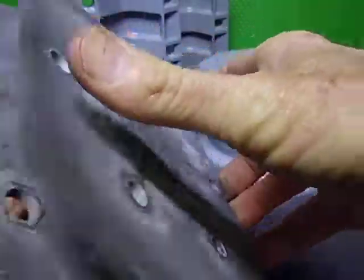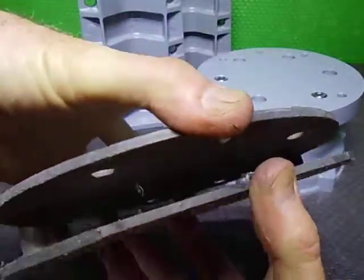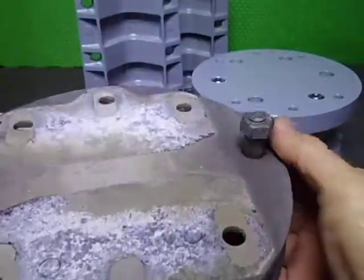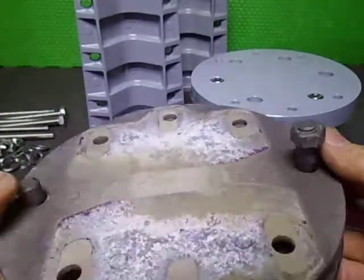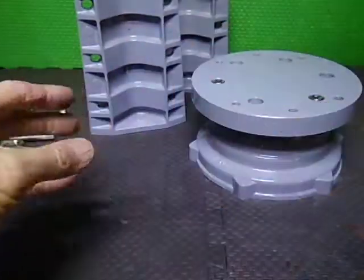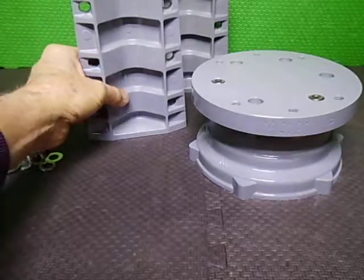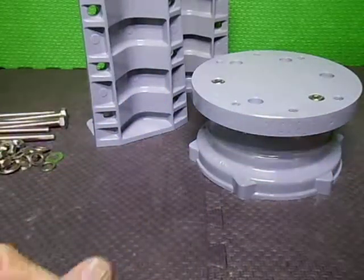They've only got 2 bolts in there, a bolt either side, and a pivot pin in the middle. You see the pivot pin in the middle, and it's mainly used on Panzer masts to take out any misalignment on the taper of the Panzer mast. Again, they're just noisy and I just don't like them, but not a problem. That's how they are. So these mast clamps were developed for the 1500 and 1800, and on the 1300 they used that adapter plate. So this is just taking that adapter plate out of the equation, because it is steel, galvanized after all.